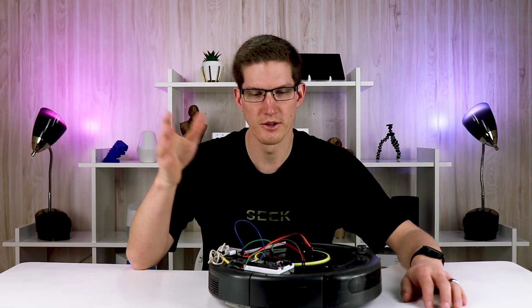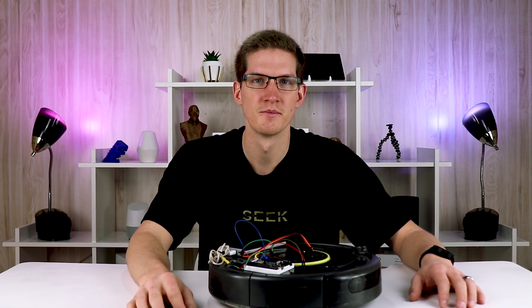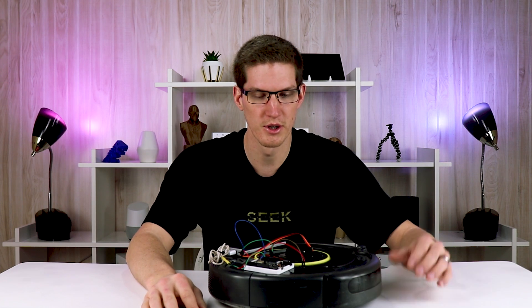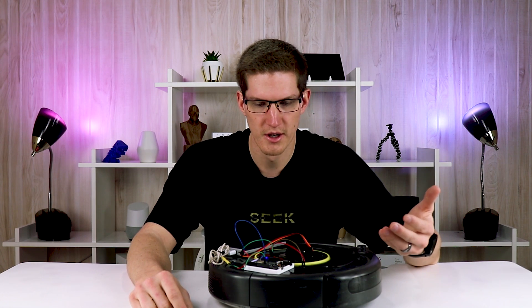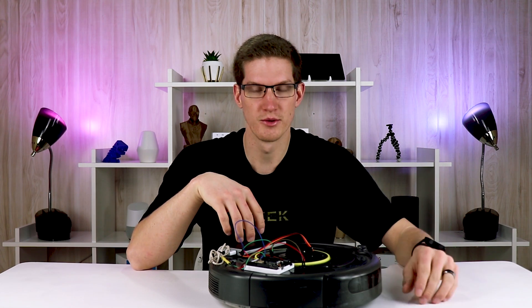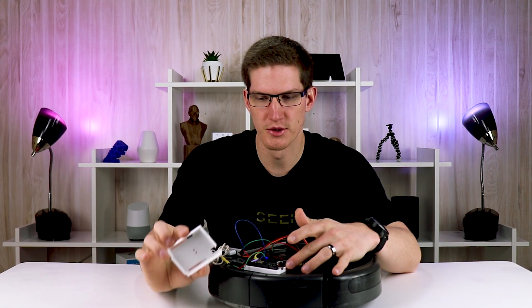"Turn on the vacuum." It has connected to our Wi-Fi and is broadcasting the signal. The servo moves twice — or once if you edited the code that way. The Roomba will do its cleaning, go back to the base, charge, and put itself back to sleep. This can be added to an Alexa routine or tied to presence sensors so it runs when you leave the house.